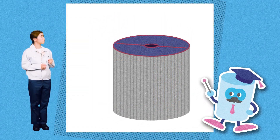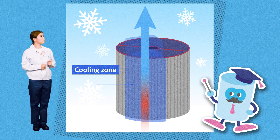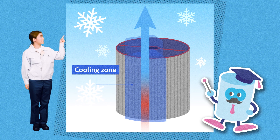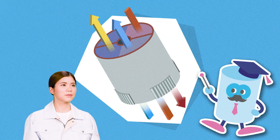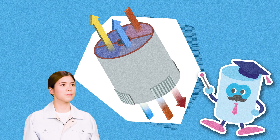After being heated in the regeneration zone, the honeycomb rotor moves into the cooling zone. There, it is cooled to the optimal temperature so that it can dehumidify air again. So it reverts to its original state. By repeating this cycle of dehumidifying, regeneration, and cooling, the system maintains its performance, even if the dehumidifying agent is not replaced.